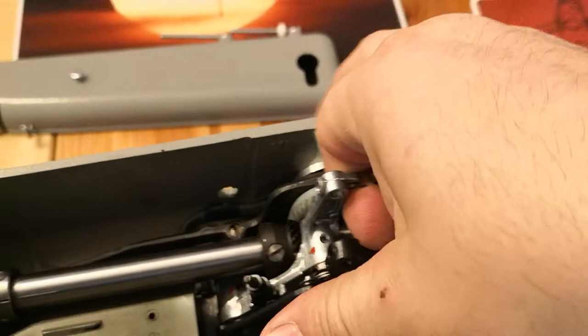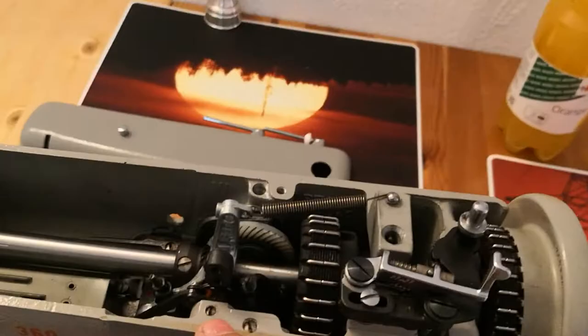...then there is a spring ring — it is crimped around a metal groove. You take a special plier to open it up, then you take it off the axis. This part here is the spring ring. Then you can open this screw and hammer from behind — slowly hammer on this part here.